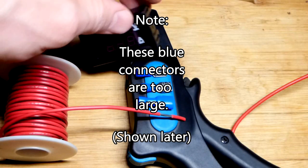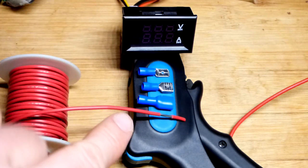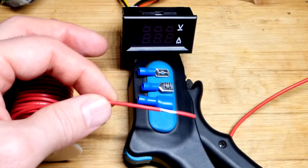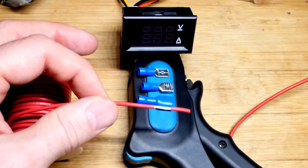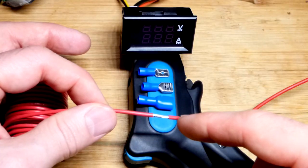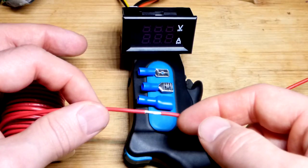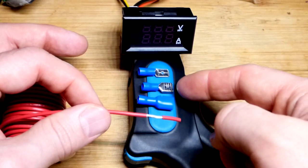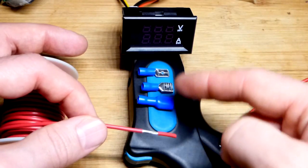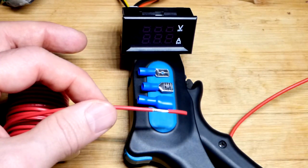When it comes to actually powering this unit you just need small wires, but you're also going to have to pass current. This is 16 AWG wire right here — we could go thicker to 14 or 12 gauge, but 16 gauge is fine since we're going to stay under 5 amps. I'm going to attach a spade connector that will let me clip to the power supply via an alligator clip. There's also a female spade right there — it slides in, though it's tough and you have to push hard. There's a plastic covering to reduce your chance of short circuiting.